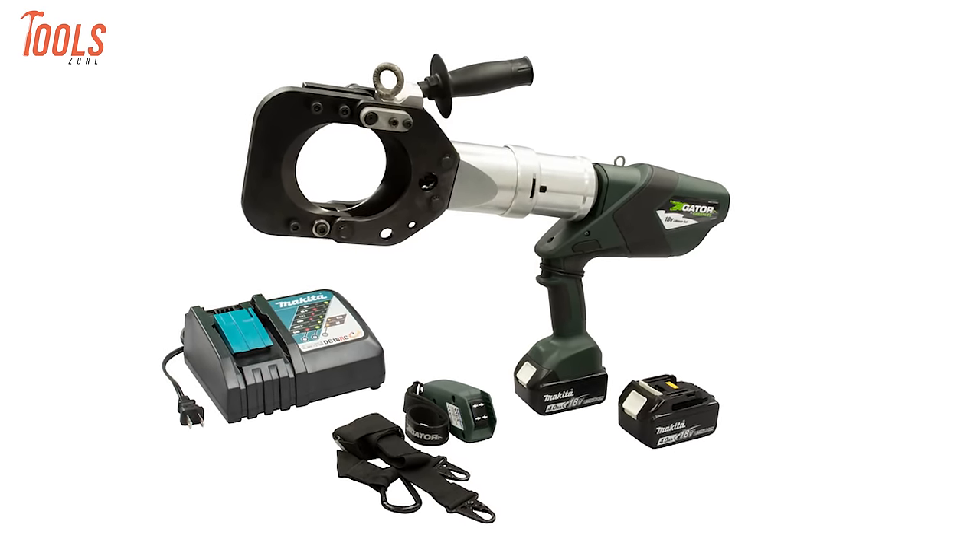Here comes the innovative Koch Stripper Number One F-Plus tool that streamlines this tedious yet essential task. This German-engineered double cutting tool strips and de-insulates in one intuitive step. Integrated hex grips swiftly screw on F connectors following a clean 6.5mm cut customized for compression fittings. There's no fiddling with blade adjustments between cables, thanks to its SmartFix stop dialed in for repetitive electrician tasks. Optional knife inserts cater to non-standard connector dimensions as well, demonstrating thoughtful design tailored for electrician workflows.